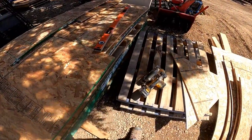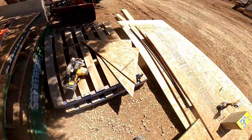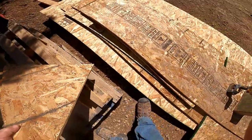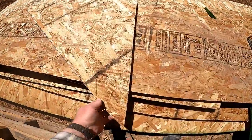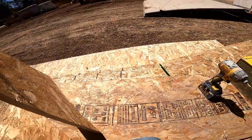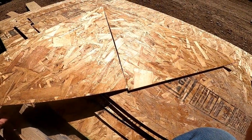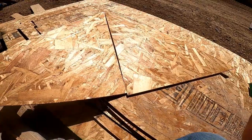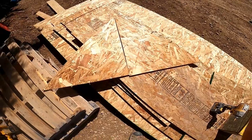I'm going to build some gate column caps out of these scrap pieces of plywood. The cap is going to be out of concrete, so we're just building the form for it. We're going to have four of these. They'll go like this — upside down in the form — and they'll slightly slope so that the top of the cap goes on an angle to shed all the water off the top. We're going to pour them in the upside-down position.